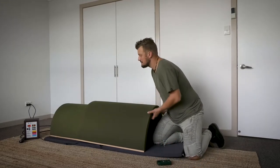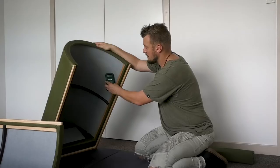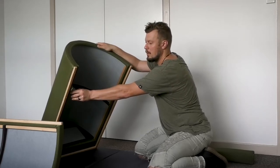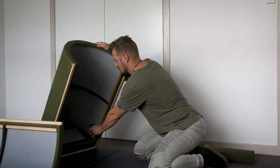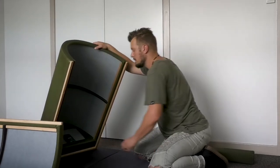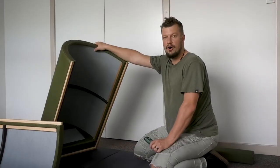I will also test the second dome, just to confirm it is consistent. By the way, in our manufacturing process we measure every single heater. Getting a reading of 0.1 here, 0.1 directly on the heater in the middle as well. Going on the bottom of the two heaters — 0.1, then 0.2 to 0.3 on the right-hand side, which I do expect, and 0.1 on the other side. The foot heater is at 0.1, and in the direct middle it is 0.1 milligauss — that is about one-thirtieth of the recommended dose.